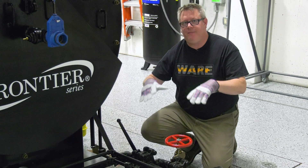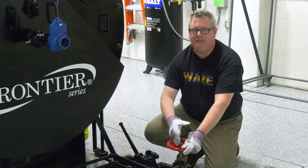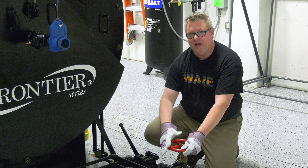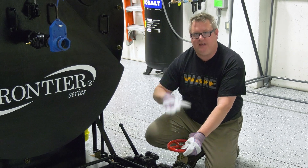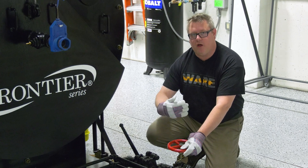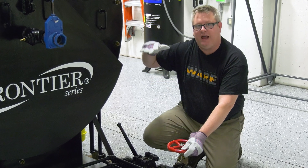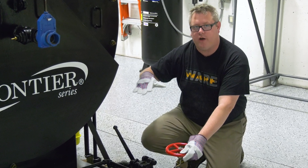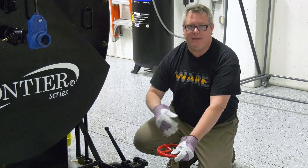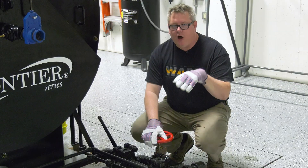If conductivity had been high on the boiler, I could have extended that blowdown in the open position — maybe five seconds, ten seconds — before closing it, and that's going to help get the boiler conductivity down simply by dumping more water. I don't really want to do a bottom blowdown longer than 10 or 15 seconds max, because I could actually run the boiler low on water. I'd be better off doing a second blowdown in maybe four hours to bring that conductivity down if needed.